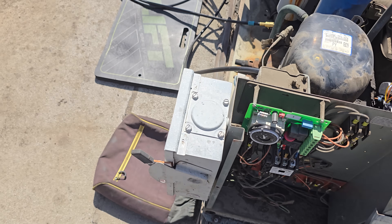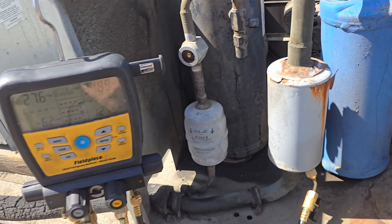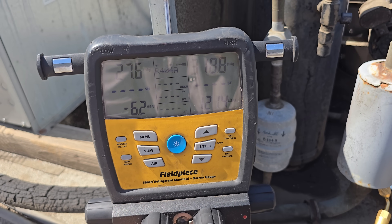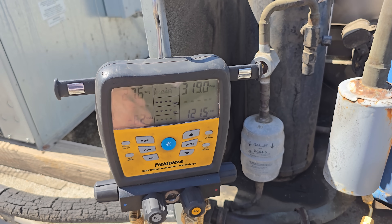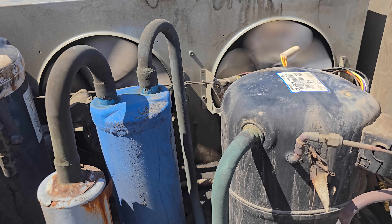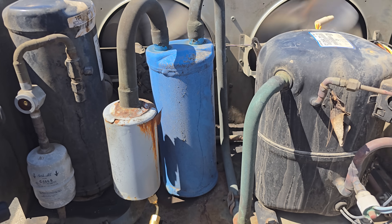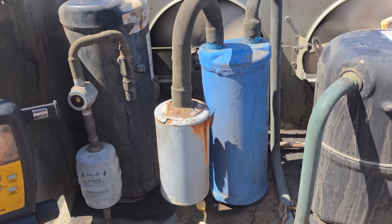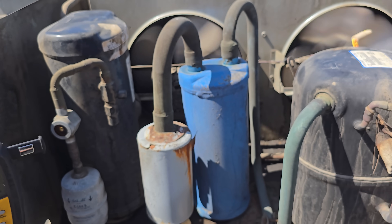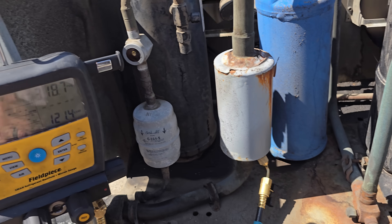It looks like it's about to go into defrost, but I clicked it through so it'll be a little off - we don't need a defrost right now. We're running about 121° liquid saturation. It's about 103° outside, so that's approximately 20 degrees over ambient - that's fine. You never want to be any more than 30 degrees over ambient when using discharge pressure compared to ambient temperatures. Always be careful when checking liquid pressure because there could be a pressure drop across the receiver and condenser. We're on discharge pressure and suction pressure.